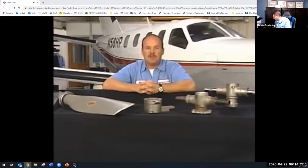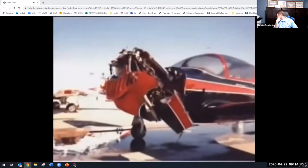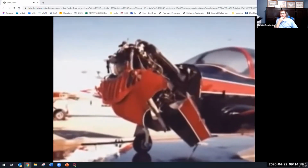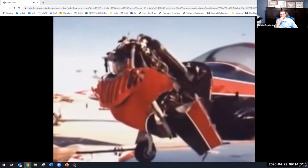This leads us to believe that there are aircraft with annuals signed off when there is corrosion or damage evident on the propeller. The failure of a propeller may have more dire consequences than an engine failure. If an engine fails, the pilot may have the option of gliding an aircraft to a landing spot. However, if a prop fails and throws a blade, the vibration loads placed on the aircraft can rip the engine from its mounts, rendering the aircraft uncontrollable.